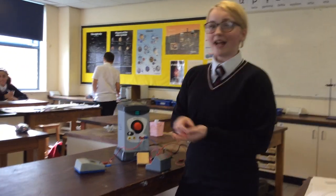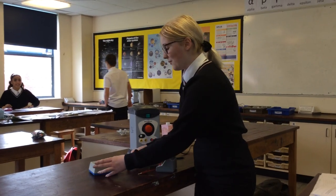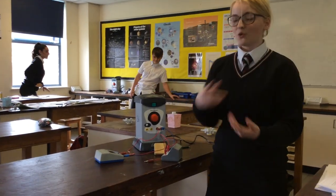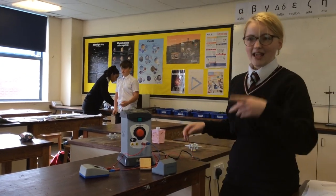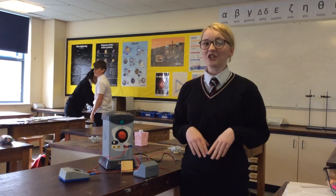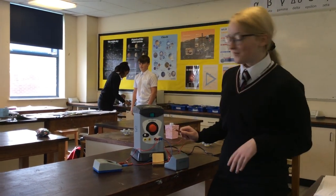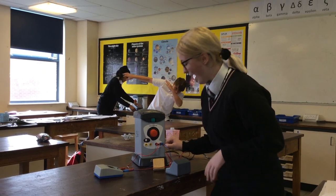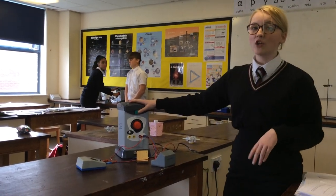So we get wire number one — we don't drag it off the table. We plug it through to the bulb because it's in parallel to the bulb, since we're measuring the voltage as it travels from point A to point B. Point B is back in our power pack, so we plug it into that one, and then we can turn our circuit on.